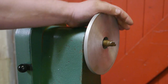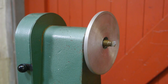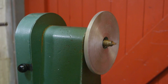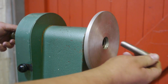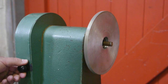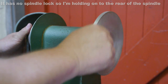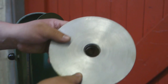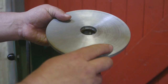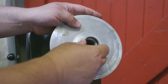So here's the business end of the lathe, and it has roller bearings — so no more messing with oil for me. That's a big plus. It has an MT2 drive spur, just like the tailstock, and you need to punch it out. There's also a face plate. By the looks of the surface finish, I would say this is homemade, and since there aren't any holes, it was probably never used. I'm not a big fan of aluminium, but it does have a steel insert.